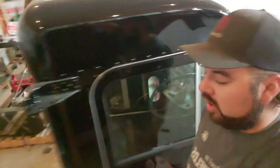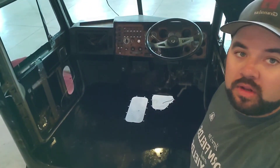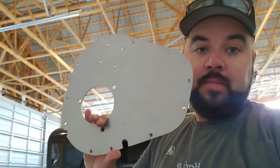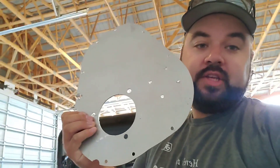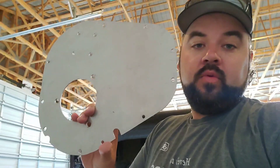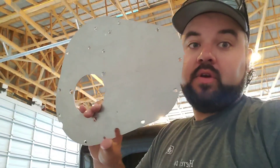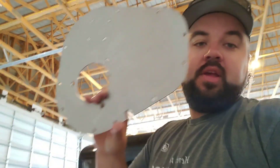We are going to work on — I got all the parts to put the foot valve back into the cab. There's the floor all painted up looking good. The plate that the pedals mount to is pretty rotten, so Todd actually made us a new one. I actually had to make a second one for the other truck as well in case it ever goes bad. We'll get the foot valve, the brake pedal, the pedestal for the throttle — all that stuff mounted.